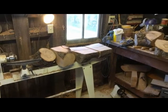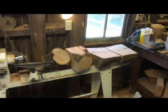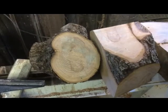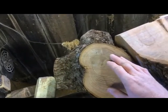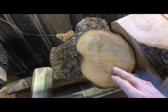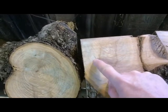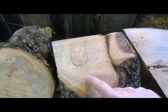So I didn't show you the whole entire cutting process — it took a while — but I got some beautiful pieces out of that multi-branched item. What I look at is the end of the piece: is there different coloring, different designs, different waves of the wood? In this piece you have a really dark area and some light areas up here, with a little pattern that's going to give me some good figure. This piece has dark and white, a little bit of black line which is called spalting, and then some figure coming right down the middle which is going to turn out beautiful.